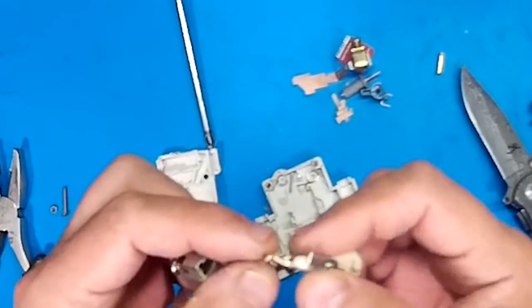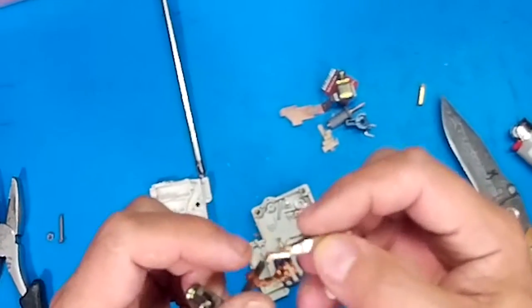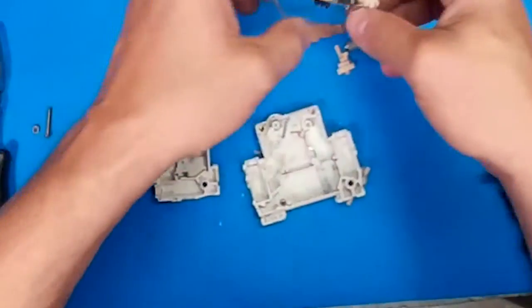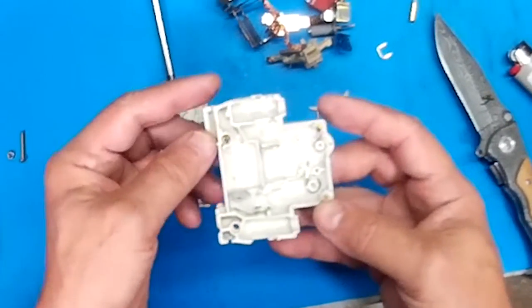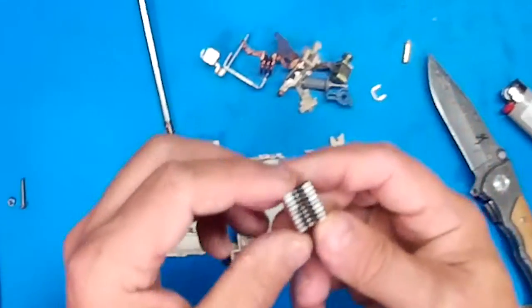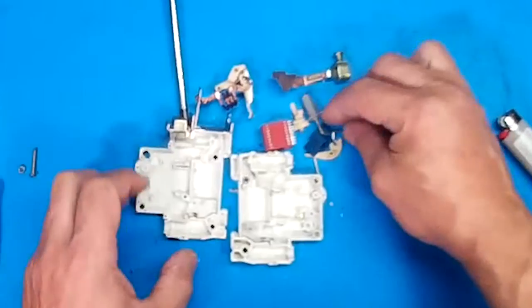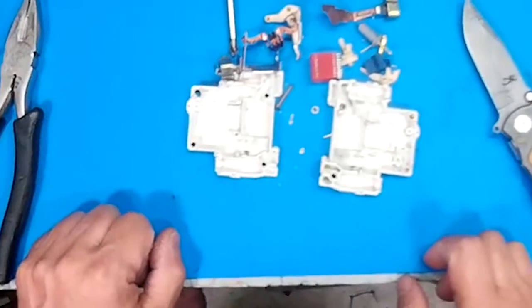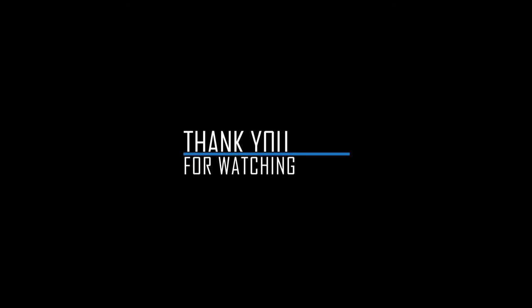This end is a little bit worn down and melted — actually it looks bent. Yeah, it's bent. It was bending and arcing every time it tripped or you turned it off and on. Only a matter of time before it just arced right out, which it has done a couple of times. It was built cheaply — wasn't designed for use on an e-bike. There's solder floating around in it and the fact that it was falling apart was reason enough just to swap it out for 15 bucks. There it goes.